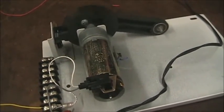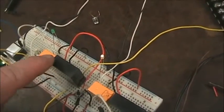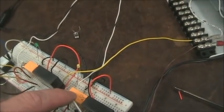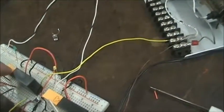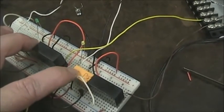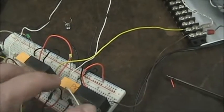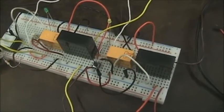There are some gotchas in the circuit, so be careful with your wiring — particularly the interconnects. Remember, the A interconnect controls the C relay, and the C interconnect controls the A relay. That's the common problem students have with wiring. If you follow the process of doing the two independent motor starters, then putting in the cross-connects, then adding the B and D motor control relays at the end, you'll usually be able to complete this lab in a timely manner. Good luck, and ask me any questions if you have them.